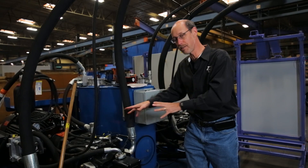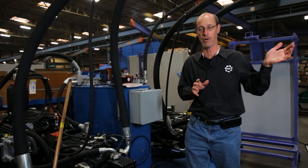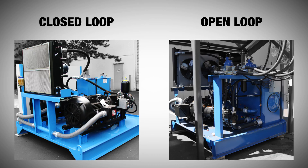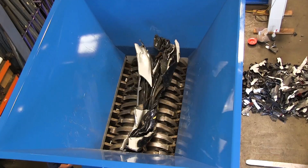The particular type of pump and the particular type of hydraulic circuit that we use varies depending on what we're trying to do with the shredder. So this one is a closed loop — we also have open loop, and we have various pressure ratings on different components. The closed loop has oil flowing from the pump to the motor and right back to the pump in a tight loop, so it has a smaller footprint primarily because you can use a much smaller reservoir.